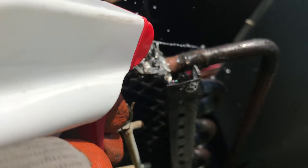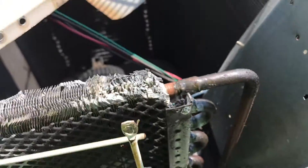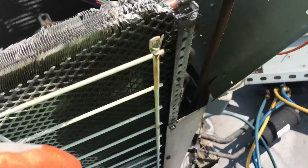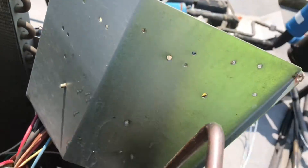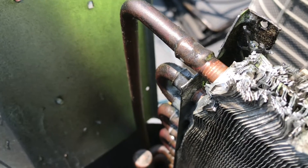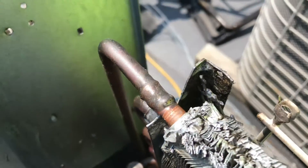It does look like the leak is just up top here. Now that I got that blowing right up, I'll have to get my reclaim rig set up, take out whatever gas is left in it. I can valve off the condenser so I don't have to reclaim the entire line set — just recover what's in the condenser, then pull a vacuum and return the refrigerant back in. I sprayed up all the other points in this area and this top one is the only thing I see leaking. Once we get this fixed I'll do a good pressure test to make sure that's the only issue, but we'll have to start with one thing first.